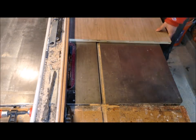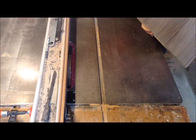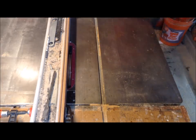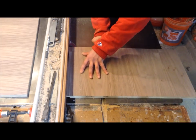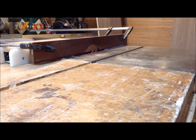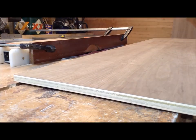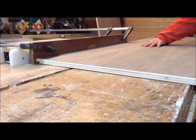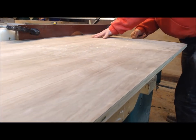After I had my pieces cut to their final sizes, I put a sacrificial fence on my table saw with a dado stack as my blade, and I cut a rabbet on the back side of all of my pieces. The rabbet is about a half inch by three-eighths of an inch, which accounts for the thickness of my backer and gives me enough depth to screw into it — because the customer specifically wants the backer to be removable. I sent all of my pieces through so they have identical rabbets on the back.